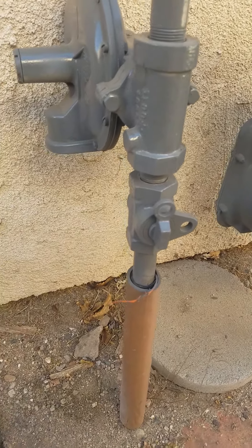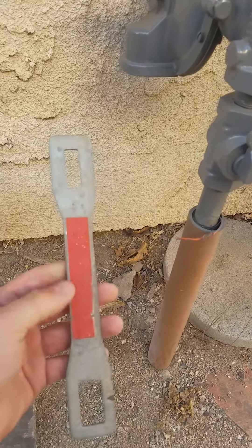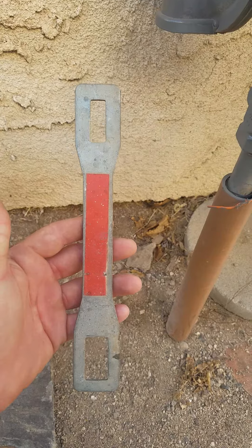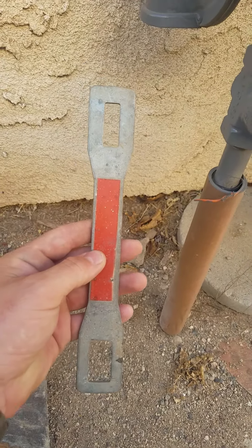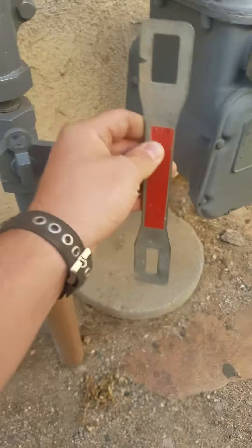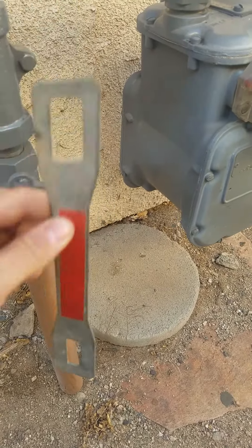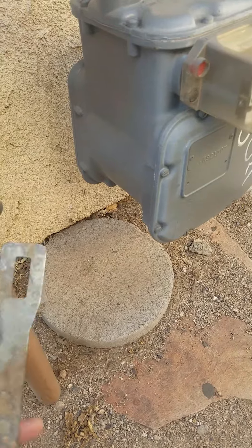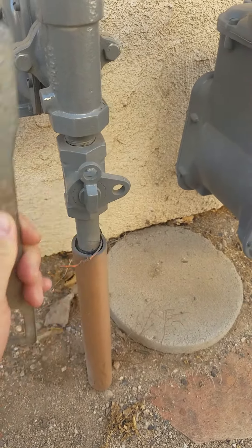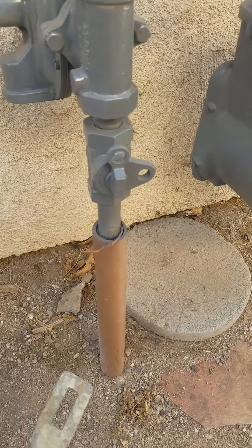To do that you will need some sort of tool, either a wrench. These pre-manufactured wrenches can be found at any hardware store and are usually less than $10. It's a good idea to have one of these on hand, and most people actually keep them out next to the gas meter — they'll wire them to the pipe so that it's always out here. You're not going to be able to turn this off with your fingers, so it is a good idea to have all of this ready in case you needed to turn it off for any reason.